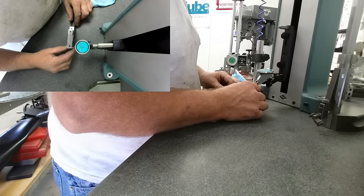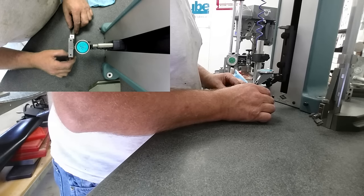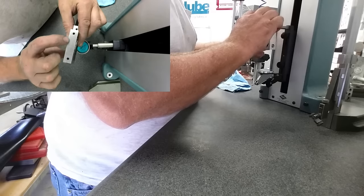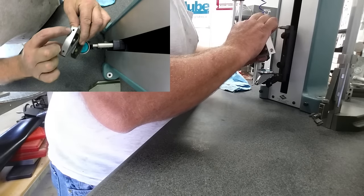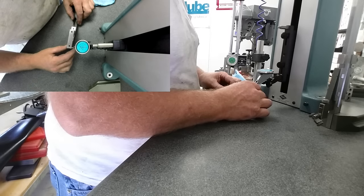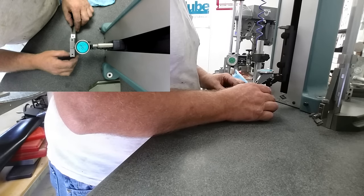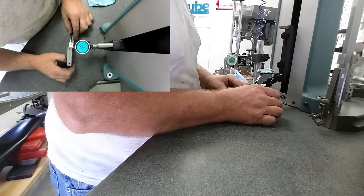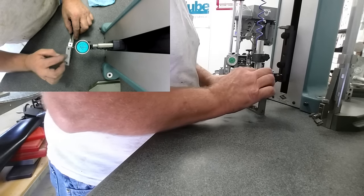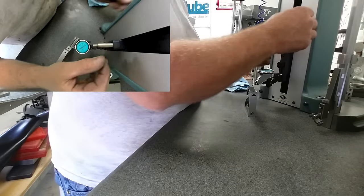Well, it's the same thing over there. I think someone worked a wedge into this at one time or another. And if you look carefully at this grind, it doesn't look like a factory grind — I see a little chattery stuff going on there. I'm thinking that top's been reground, but not very well. So we've got about a thousandths difference between one side and the other.